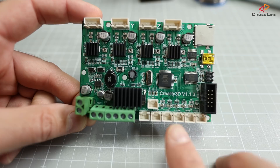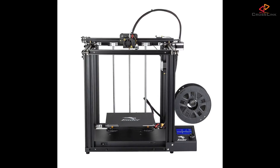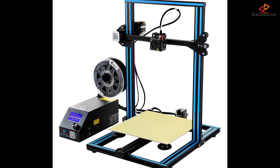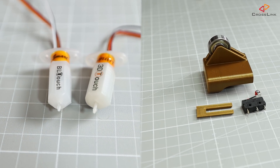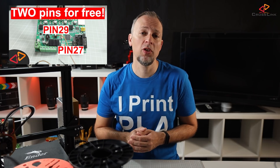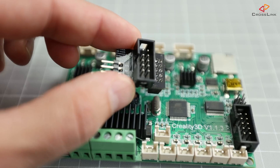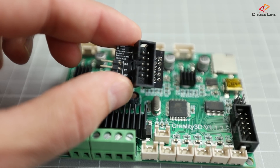The Creality 8-bit mainboards used in most of Creality's cheaper models — like the Ender 3, Ender 5, CR10, and more — don't have any additional connectors for things like filament sensors or a BLTouch probe by default. That may change with new models that have a 32-bit mainboard. If you've missed my video about how to get two free GPIO pins on these Creality mainboards, I highly recommend watching it. After watching that, you will know how to either solder a cable to the mainboard to get pin 29, or how to install the cheap pin 27 display cable adapter to get a free pin to connect your filament sensor — I've linked that adapter in the description.